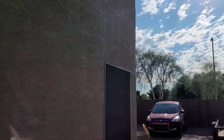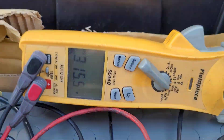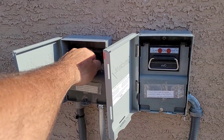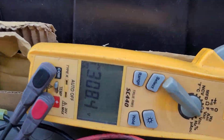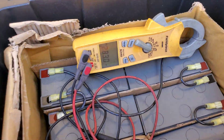As the sun starts going down further it'll start pulling down on the battery, so at this point I want to go ahead and do the test at about 315 volts. I'm just gonna pull the solar power here — so now only the battery is going to be powering the AC unit. The voltage should immediately start to sag. After one hour it's still running but the voltage is way down to 283.